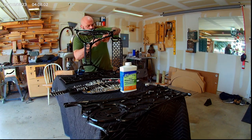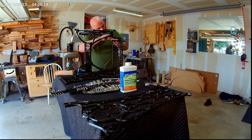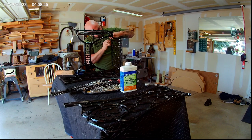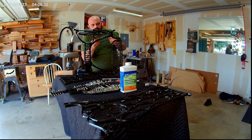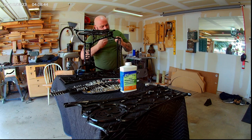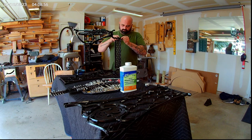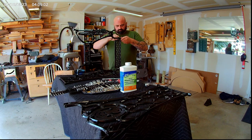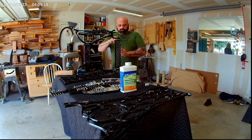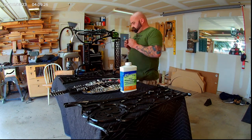The treadle is then attached to the drive shaft with this adjustment rod. This bearing that's on the drive shaft I couldn't get off, so we had to work around and clean and oil and grease in place. This bushing style bearing fits onto the treadle and swivels with the motion while the rod is threaded into that bearing on the drive shaft.